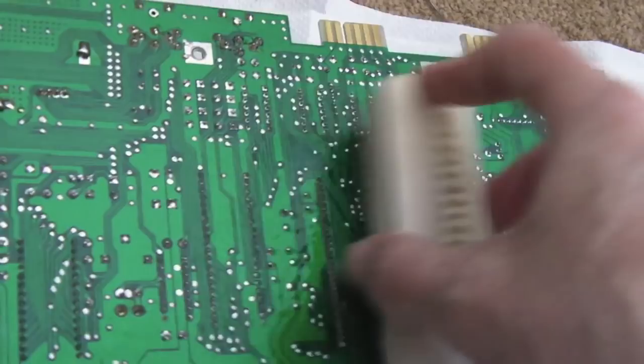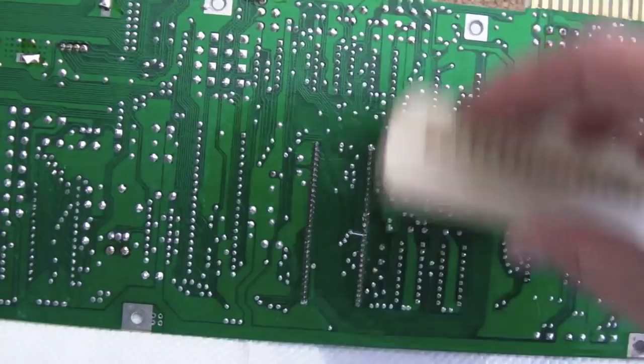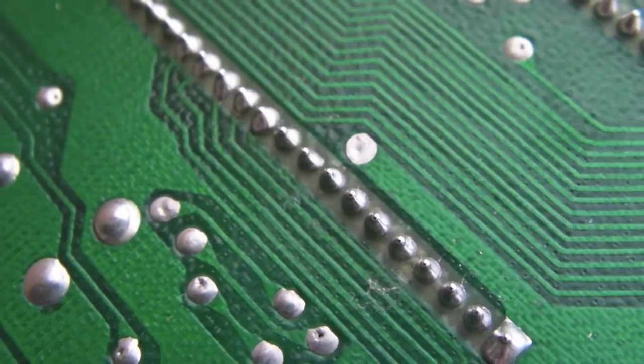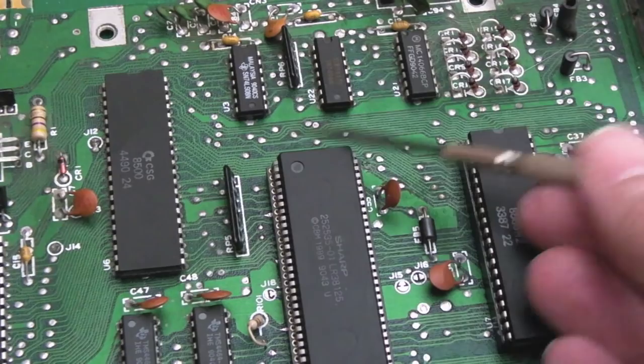Yeah, it's looking good - actually a nice tidy job. Having a quick look on macro, the socket looks really good actually. There might be a bit of solder on that trace there - I'll clean that off. We'll get the chip in and give it a test. That's our PLA socketed now. It was being a bit of a meanie actually - it wouldn't go in. I did have to try and straighten the pins again, experimenting trying to get it in on each side one at a time until eventually it went in. Pin one at the top here - yeah they're all marked the same way on these sockets. We'll connect that up now and keep fingers crossed.